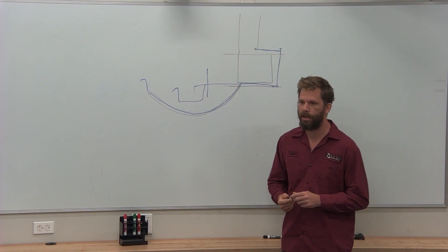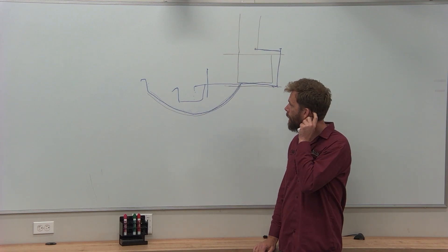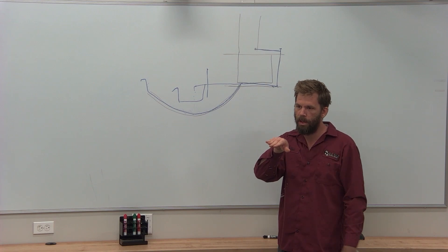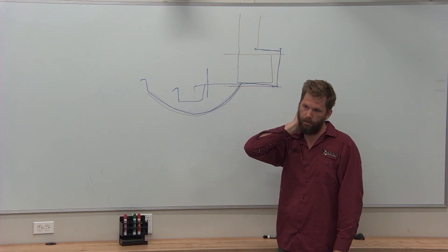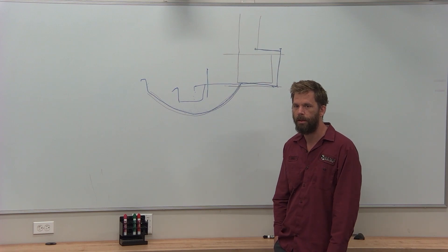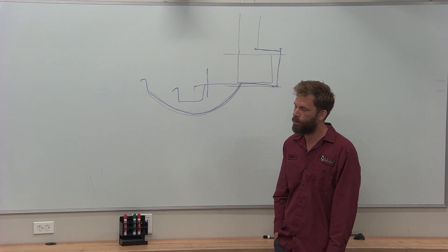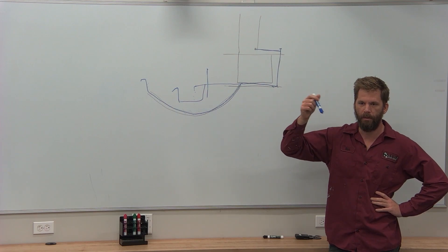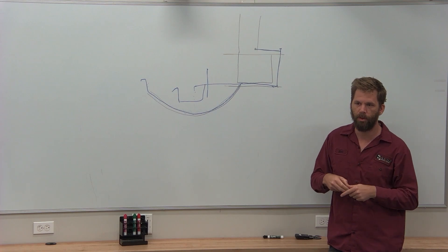There's a chance that this was trapped somewhere in the walls and somebody eliminated it for a reason. Don't add extra traps to your drain for no reason — that's an important lesson. You can have your attic trap or your upstairs trap, but if you show up and the system visually has zero trap — air handler, no trap, goes straight out the wall — that thing has a trap somewhere in the walls. It wouldn't be running without backing up without a trap. So it's trapped in the walls; if you add a trap, you're going to have to add a vent in between the walls and the new trap. The bubble can escape out the vent — that's the purpose of the vent after your trap.